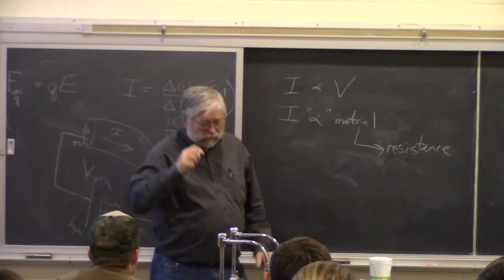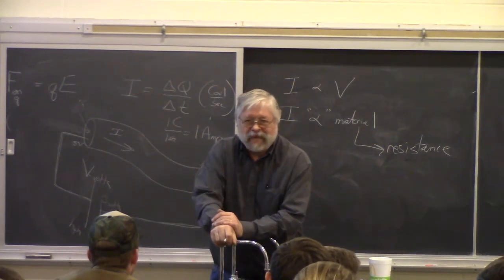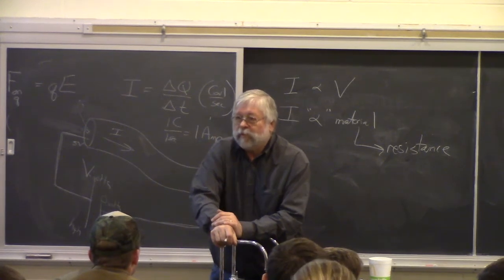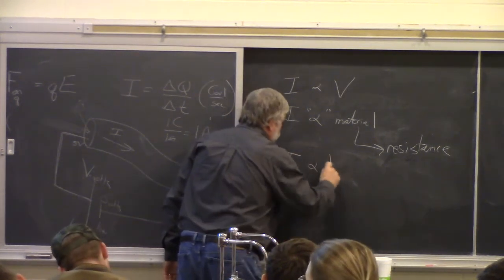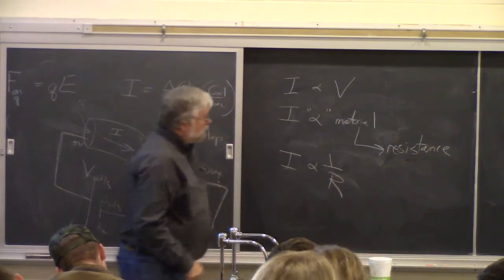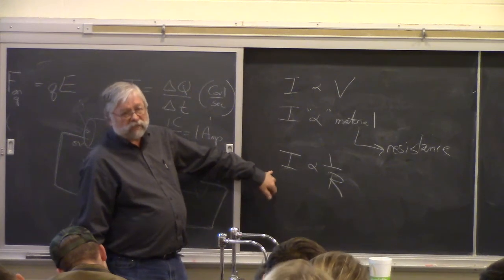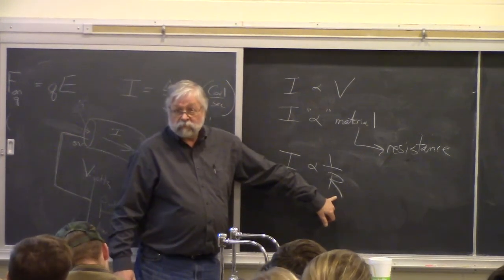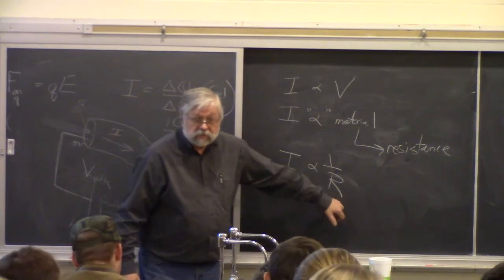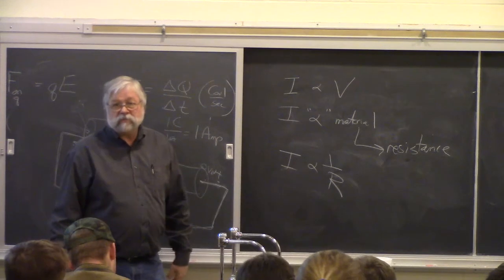Well, think about it for a minute. Resist. What's that mean? Against, limit, prohibit, something like that. So the idea here is that if a material does not allow very much current to flow, if I is small, then R is big. Big resistance, small current, small resistance, big current.